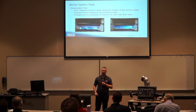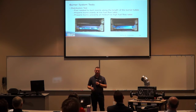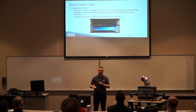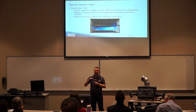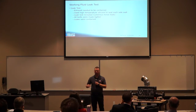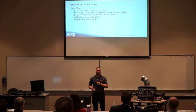We moved on to the distribution test to ensure fuel burned evenly along the entire length of the burner tubes for even heat distribution along the heat exchanger, allowing for better heat transfer and higher temperature rise. We found propane burned unevenly at medium to high fuel flow rates. We modified the base of the air heater to include a perforated diffuser plate at the bottom and two flame holders to hold a pocket of stagnant air above the burner tubes, allowing fuel to burn in a uniform and steady diffusion and pre-mixed flame. We then performed a leak test, sealing all panels and sidewalls with high-temperature silicone and testing with a soapy liquid — leaks were found to be extremely minimal and of no risk.